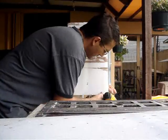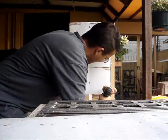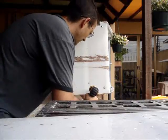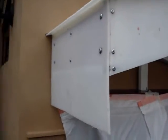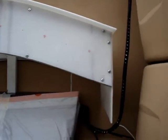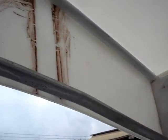I'll set up outlets inside the roof that I can plug the grid tie inverters into, and those will run back into my main box which ties into the house current. Here it is installed — I haven't painted it yet, but you can see the screws and the shape. Inside the box I've already got an outlet mounted on one side, with another on the other side and one in the middle, so I can plug in six grid tie inverters. Three will go into one phase of the house and three into the other phase — I'll show how to do that in a later video.